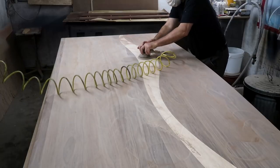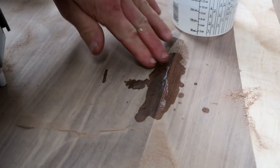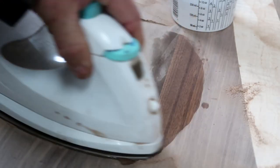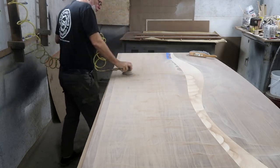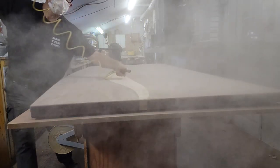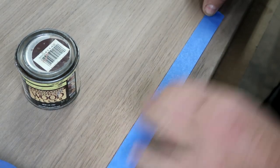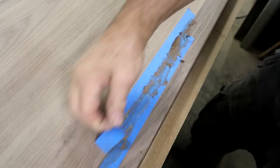The sanding is three passes with 120 grit. Sanding will reveal any dents — I had one which I soaked with water and steamed out. I then sand the entire piece — again three passes of each grit: 120, 180, and 220. I had one minor open gap on a straight-edge seam which I wanted to fill with Famowood. I tape off the seam to avoid getting filler in the open pores of the walnut, fill the seam leaving it slightly high, and sand it flush after it dries.